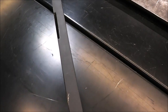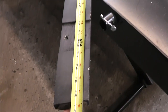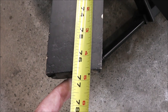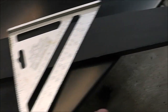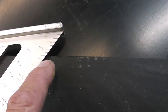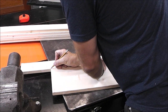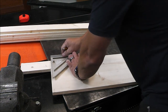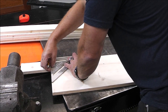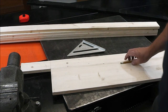For width this measures one inch. This is going to be what's called here in the United States a five-quarter board. The overall length from top to bottom is just about 77 inches long. The angle of these notches and the angle on the bottom of the leg is just about seven degrees. I like to keep things pretty simple when I build, so I'm just holding it up there, marking it out, and we'll cut that off.